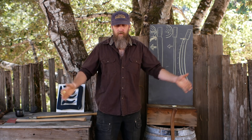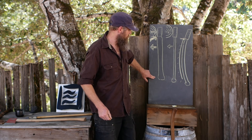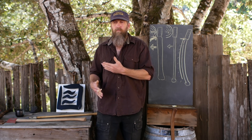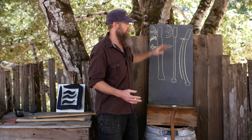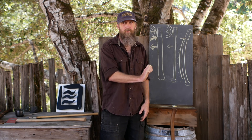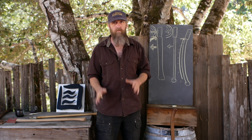Now let's do something different. Let's take a large stump, stick each head in it, drive those heads in deep so they're not going anywhere, then push on the end of each handle. It's the same concept — we're going to have a hinge point at the eye that stacks up stress. Let's flip this around: instead of viewing it as an accident, let's say we wanted to design a wooden axe handle to maximize stress in this area. Well, what we'd do is make it as thick as possible so it wouldn't bend at all — a super-efficient way to break it off. When you start to thin it down the problem becomes less and less, because it's distributing stress.